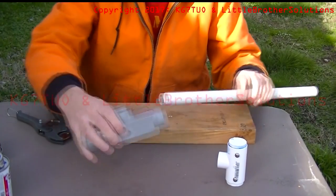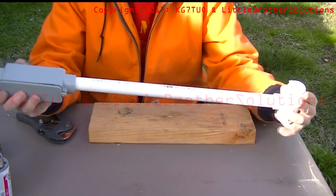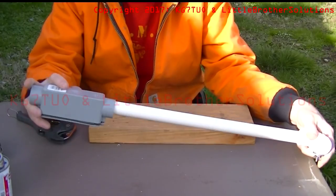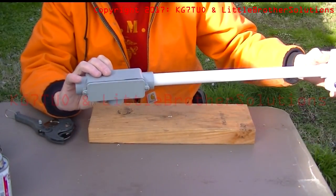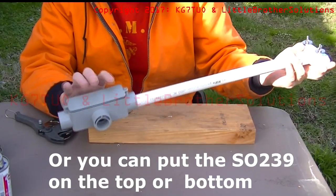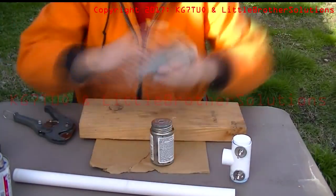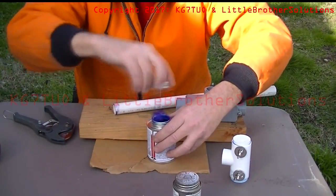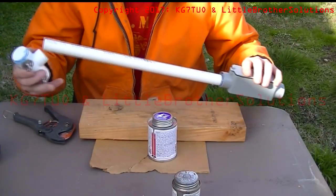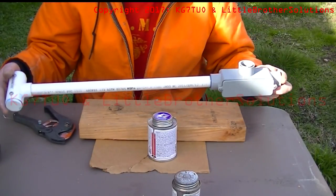18 inches — this is going to go into here, and this is going to go into here. You'll have most of the antenna built at this point. The feed line comes off the back because there's a dimple here already. So you need to decide whether you want the elements on the same side as the feed point or on the back side. We'll access it through this hole, and I'm going to go ahead and glue this up. Once that cures, this goes on the other end, and we will drill it for the feed line.